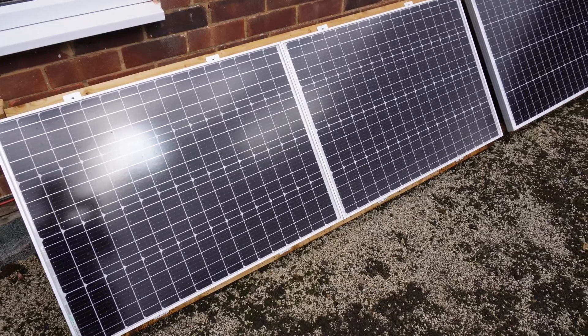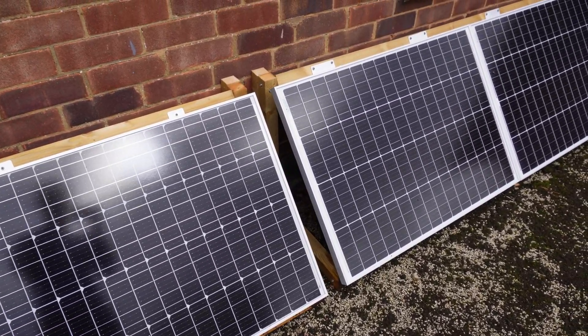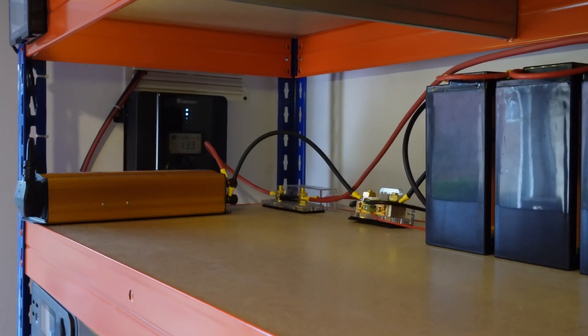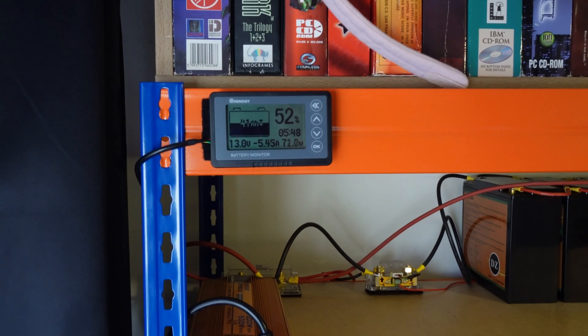A full rooftop solar system is going to be a far better investment in pretty much all other cases, because the price per watt generated is going to be much lower the bigger the system, and because it ties into the house electrics so you can actually use every drop of power that you generate. We're looking at moving house in the next year or so, and it's definitely something I'll be looking into. Unfortunately, although this DIY kit is all pretty standardised and you can mix and match parts from different manufacturers, building what I have here into something that could power the whole house would end up being much more expensive than just getting a professional installer in to do it all from scratch. I'm hoping I'll get a chance to reuse this in our next house in an off-grid studio or garden office so it doesn't go to waste.